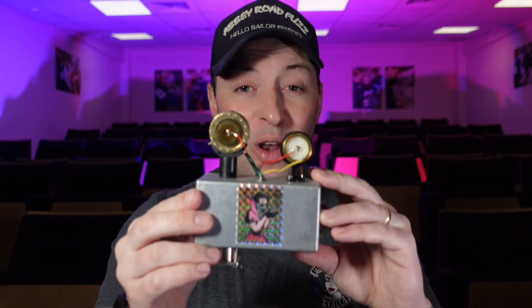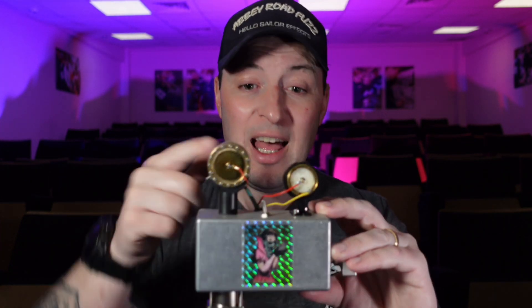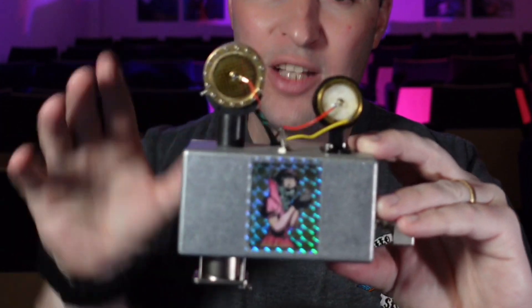Lots of people got in touch and asked: did I really need to change the circuit? Well today we're going to find out. I've created a crazy contraption where I've mounted both a large diaphragm condenser and the original small diaphragm condenser from that cheap Chinese microphone in the same enclosure with the old circuit, and I have a little switch that switches between the two capsules. I'm going to test out which capsule sounds best. And just for fun, I'm also going to throw in the cheap Chinese microphone that I modded last time round and my Sontronics STC2.